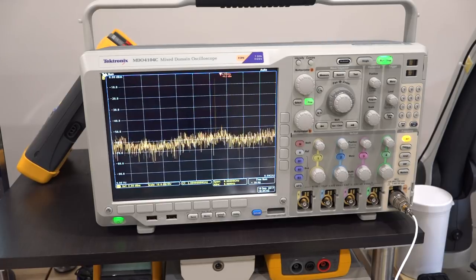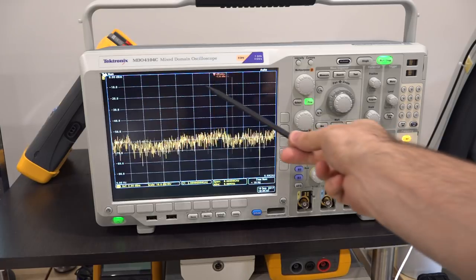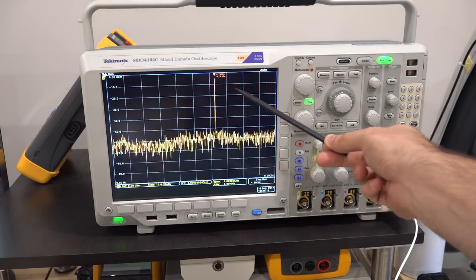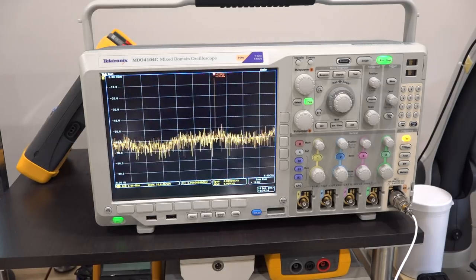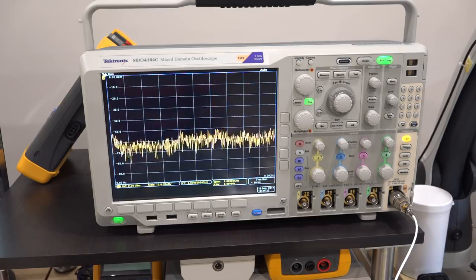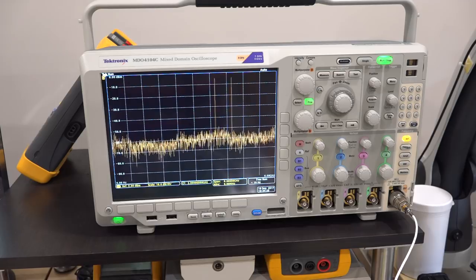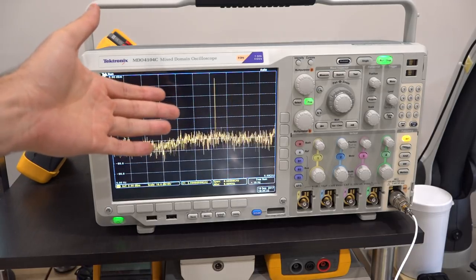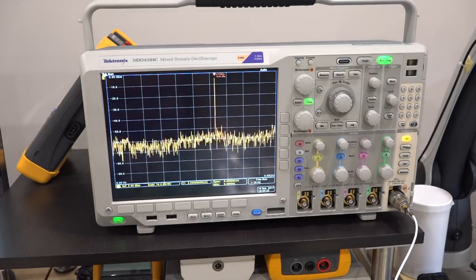The instrument has just been powered on and is on free sweep — it's going crazy. But this is a good sign: we see an LO signal. Its amplitude is about minus 4 dBm. I tend to remember it used to be higher but I can't quite recall. It is from a coupler so I'm not too worried. Let's go ahead and set the instrument to zero span — that will remove this crazy sweeping and help us see where it settles.